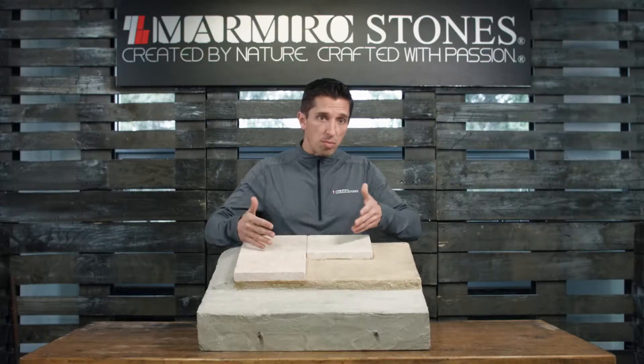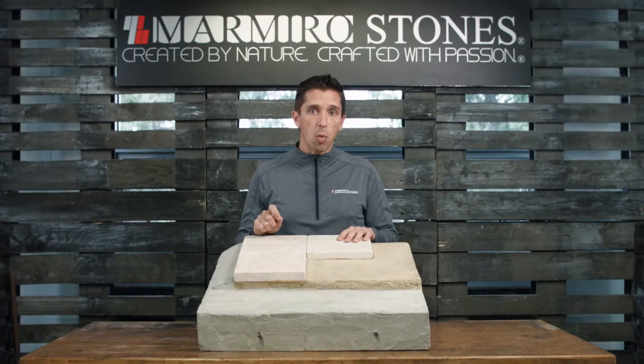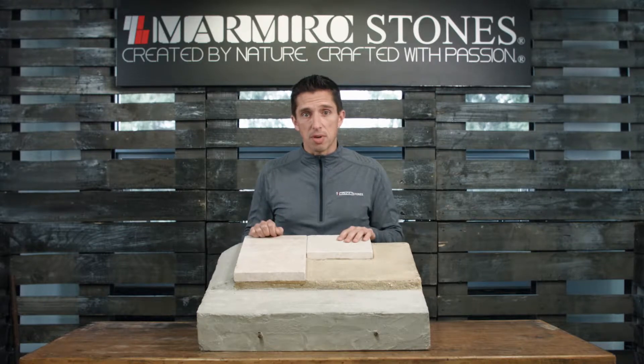During the excavation process you want to slope that subgrade, mirroring your final elevation, no less than 3/16 inches per foot or one and a half percent. Based on your soil type, tamping of that subgrade may be necessary.